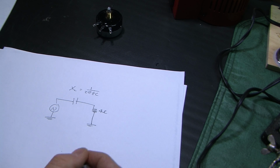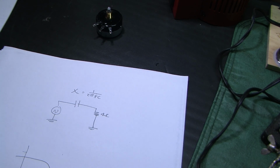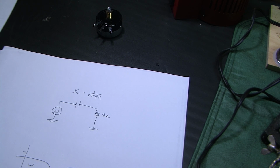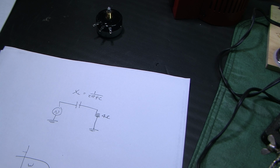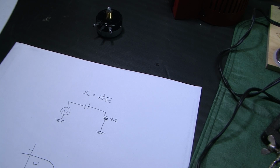The 3 dB point, okay, let me draw my diagram here. Here's the woofer. The negative 3 dB point. Here's the tweeter. This frequency right here on the woofer I'm going to determine experimentally, but first, for the sake of how to determine the capacitance here, let's say it's 1 kilohertz. So let's say we've determined the woofer to be at negative 3 dB at 1 kilohertz. That means we want the tweeter to have a negative 3 dB point at 1 kilohertz. So now we know the F.